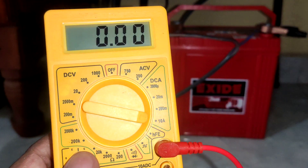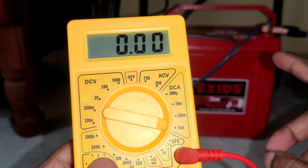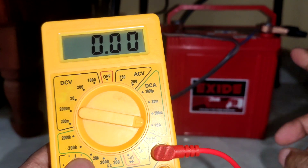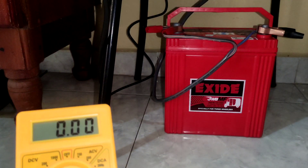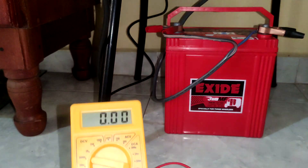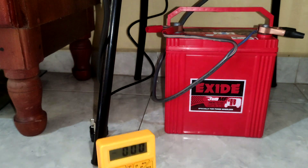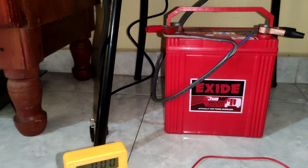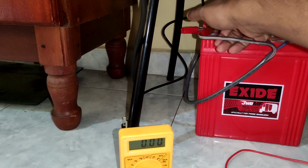Currently I've switched on a light through this UPS supply — it's a 20-watt, 240-volt light. Let's see how to make the circuit and check it. Simply, for an amperage test, the multimeter should be part of the power supply circuit — in series.